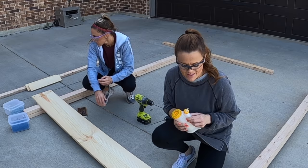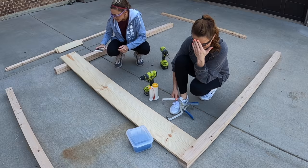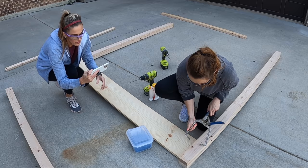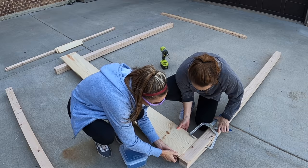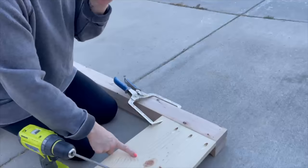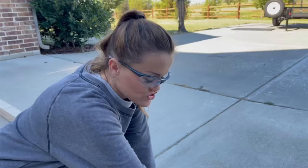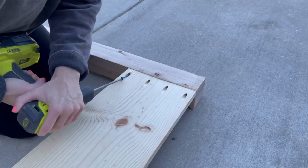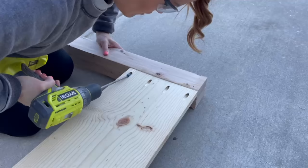So if you want to get me some screws out, that would be awesome. Screws incoming. So we've added three-quarter inch pocket holes on the ends of this board and I'm going to attach it on the first side. Now this is going to be flush with the top and flush with what's facing me right here. So I'm using my Kreg clamp in place — we will add a link in the description box below. It's nice to have my sister to help. And we're attaching using two-and-a-half inch pocket hole screws and wood glue. Once I'm done, now we'll do the other.